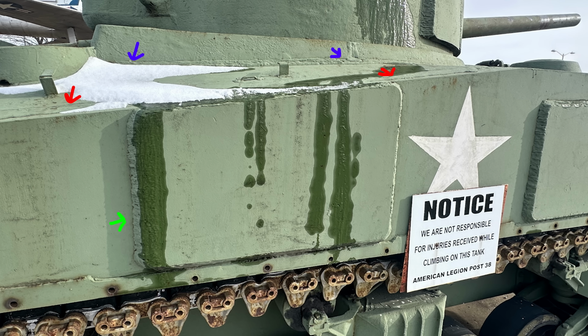and it will prove why they did this. And you guys, again, have to remember that the armor this tank is made out of likely either has high carbon content or some form of an alloy that doesn't like to be welded, aka brought to welding temperature molten metal and then re-solidified fast. And when you just try and use, say, a mild steel rod on this, what'll happen is it's going to crack as the weld cools, and or if it takes an impact force, the weld will fail. So their solution around that problem was to use high chromium, aka stainless, or high nickel rods. And the welds those rods put down do not become brittle like a mild steel rod. So again, they didn't do it that way to put down gangster welds to prove they could do it. It was kind of a necessity.